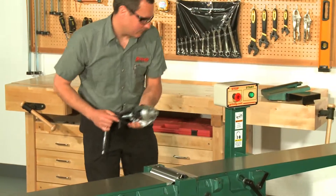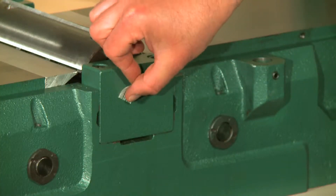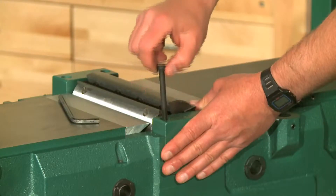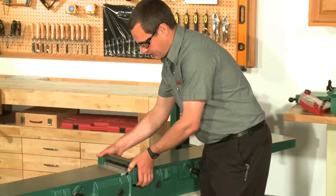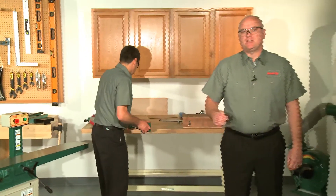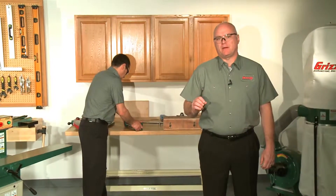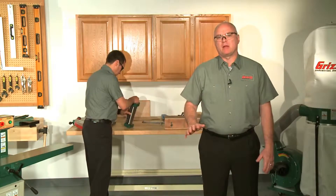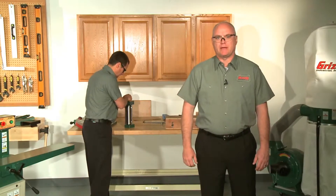You can also flip the knives over so the sharp edge is facing down and secure them by tightening the gib bolts. Remove the pulley from the cutter head. If it won't come off by hand, use the puller to remove it. Whatever you do, don't try to take it off by hitting it with a hammer. Mark the front bearing block with a piece of masking tape for reference and remove the cap screws. Then carefully lift the bearing blocks and the cutter head from the casting. There may be shims underneath one or both of the bearing blocks. If there are, just mark them front or rear and put them to the side. You may or may not need these when you install your new cutter head.